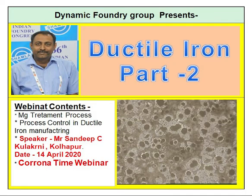Also, it helps in freezing of alloys. Sometimes metal inside the pocket will help to freeze the alloy, that metal and covering punching together, and then you will not be able to get the proper reaction, and whatever metal you are pouring is not properly mixed with the magnesium alloy, and that whole metal gets converted into very bad quality metal. So you have to take care that there is no slag, no material, no metal inside the pocket.